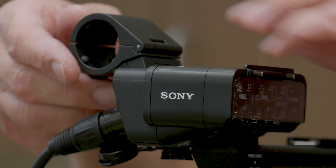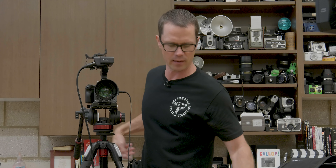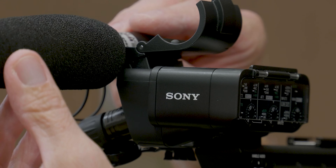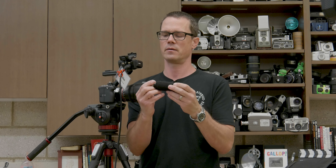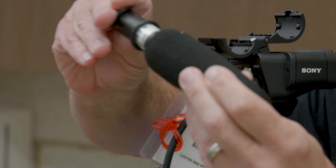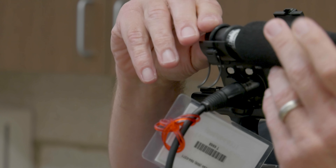The handle does record at 24-bit audio, so you have a lot of quality. If you're not using the handle, you don't have access to 24-bit — it'll be recording at 16-bit audio. You can also place a microphone in the little shock mount on the handle — unbuckle it, open it up, and place a shotgun microphone in there. Keep in mind that if the microphone is a narrow diameter, you'll need some sort of O-ring to increase the diameter so it fits inside.